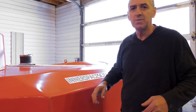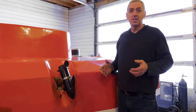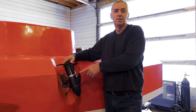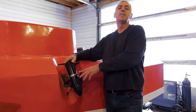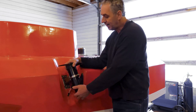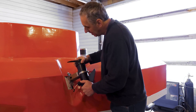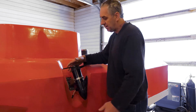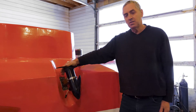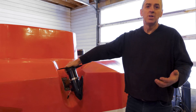Now for some safety features. This is my own personal invention — I'm not sure if anybody's done it but I'm trying it. These motors are not jettisoning normally, so if they get caught in a fishing line or rope I'm stuck on the bottom. So what I did is I mounted them on magnets. These motors will just tear away when tangled in something, but the magnets are strong enough that the force of thrust won't move them. I'm hoping it works well — stay tuned.